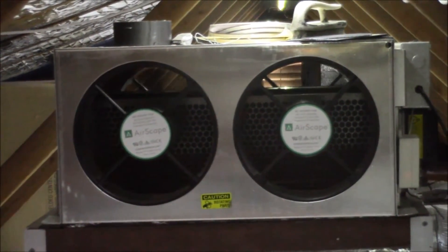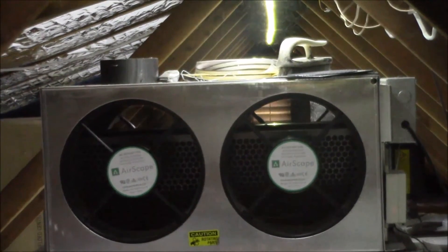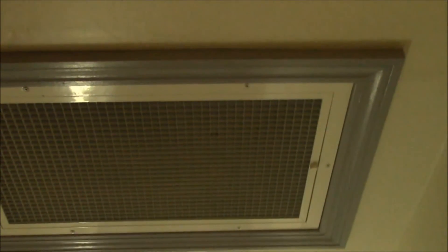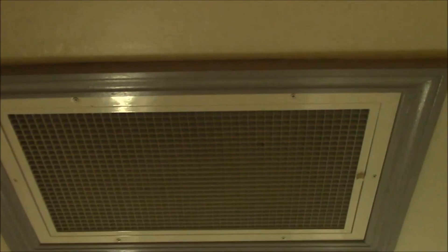If you wanted to see more information on that I can do a follow-up video on how I installed it — if you're interested, add a comment below. So just hope you find that useful: if you have a whole house fan and happen to find one afternoon that it warms up outside warmer than it is inside, you can turn the fan on for a few hours and warm up your house pretty much for free. This fan uses about 140 watts, so it'll end up using a quarter of a kilowatt hour — just a couple of cents to run.